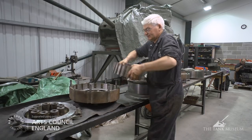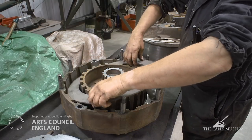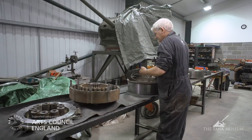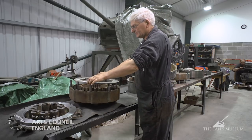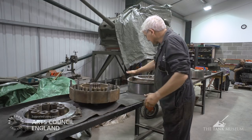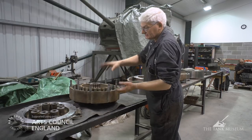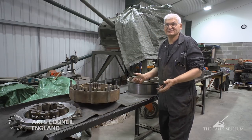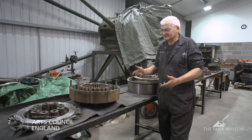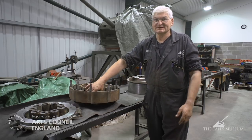That would actually be mounted internally like so — that's the inner of the clutch. Again, there'll be another friction material disc. These are loose, they're not riveted. Drops in like so. Then there's an internally toothed plate which drops around the circumference like that, and then there's a whole stack of those. When it's operated, the cams lift them off and the steering clutch separates the drive to that particular track — whichever one you've operated — and you'll do a skid steer. It's not a progressive steering like some more modern tanks or regenerative steering such as on a Comet. It's simply on and off. If you do try and do it progressively, you wear the clutch plates very quickly.